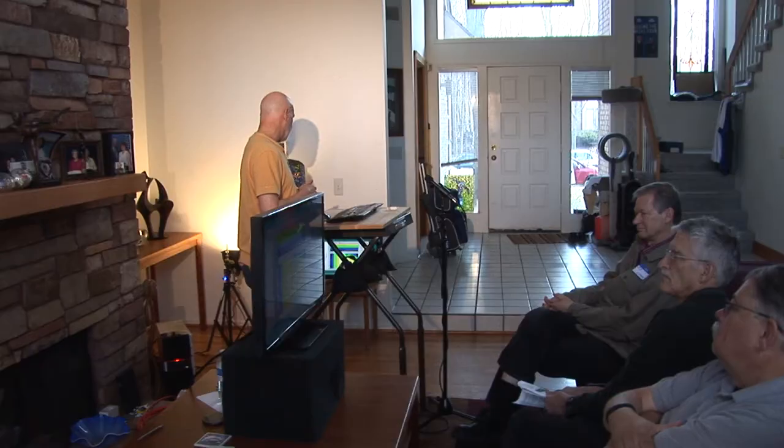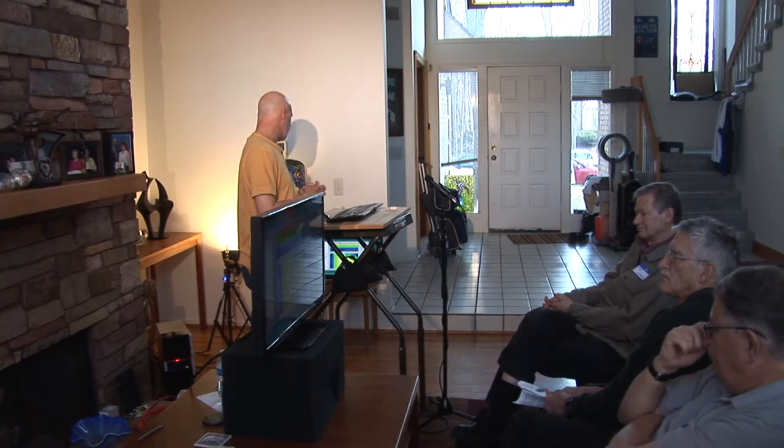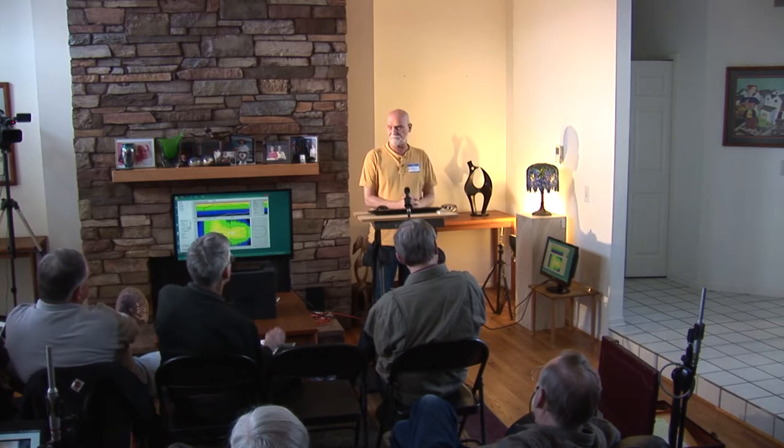This speaker, in terms of having a flat, high DI, was the best speaker I ever built — there are three of these downstairs. The DI held its character fairly high with a very flat response. This is a free-field response. My premise is that I want a flat free-field response with a flat DI on the listening axis. The listening axis is not on-axis — the speakers are toed in and cross in front of you, so you're off-axis. They're designed to have a flat DI and flat response at 22 degrees off-axis.